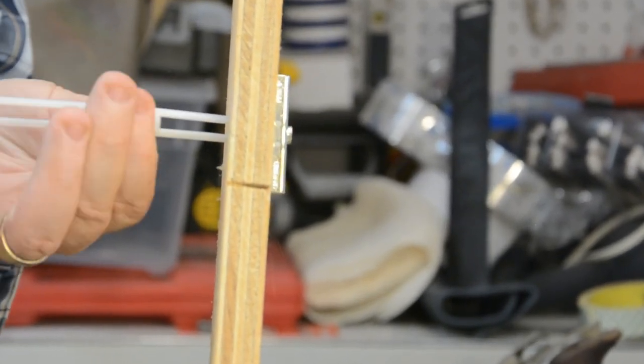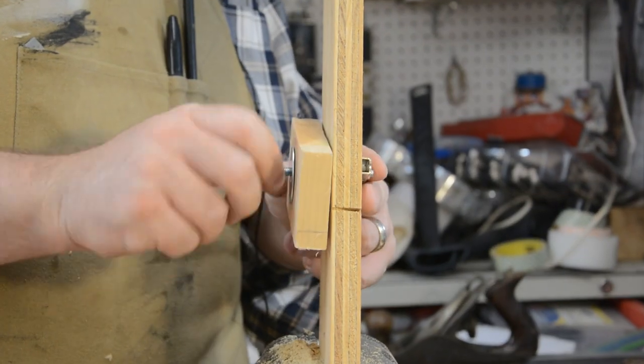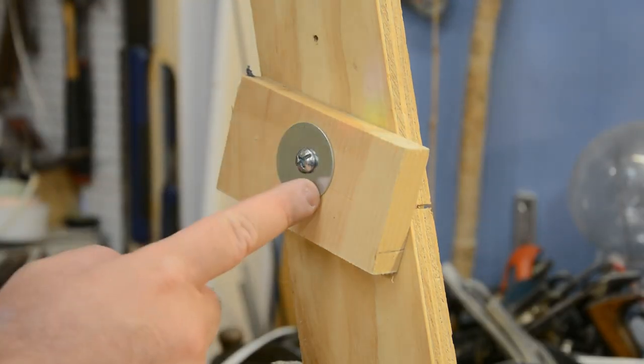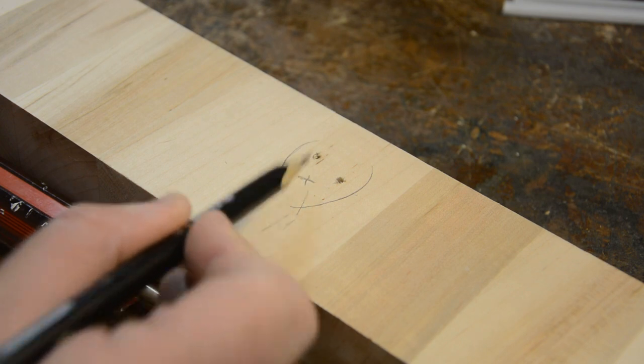You then take your plastic cap, push it up against the opposite end of the drywall, snap off your two plastic straps, and that's about it. You just take your bolt and whatever you're bolting to the wall, affix them, and you're done. Now we're going to use these toggle bolts in conjunction with the drunken octopus hooks by hiding the toggle bolt underneath the head of the octopus.